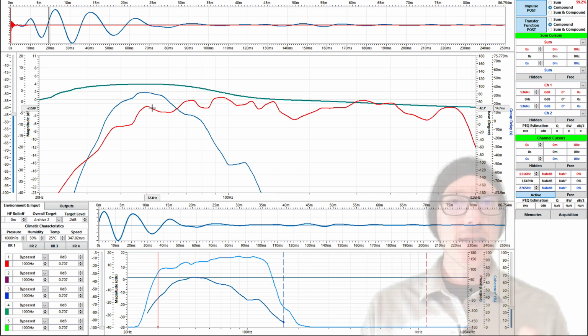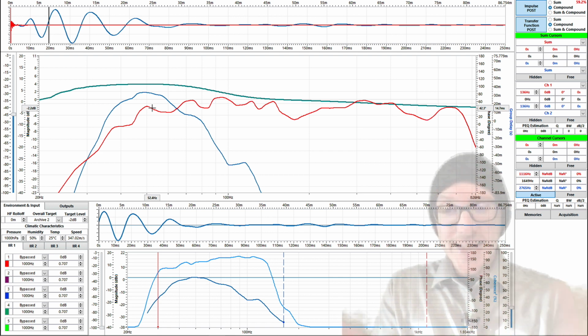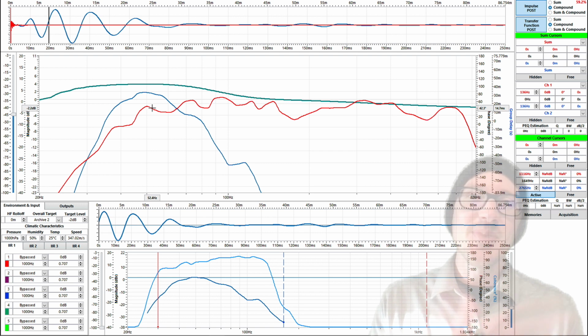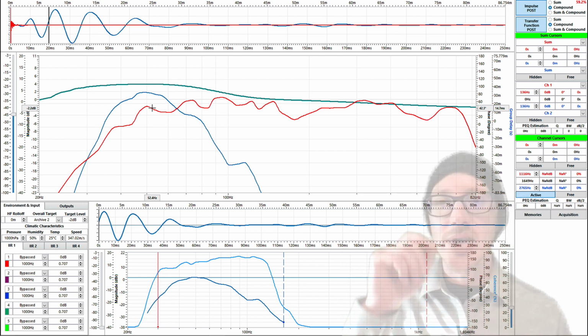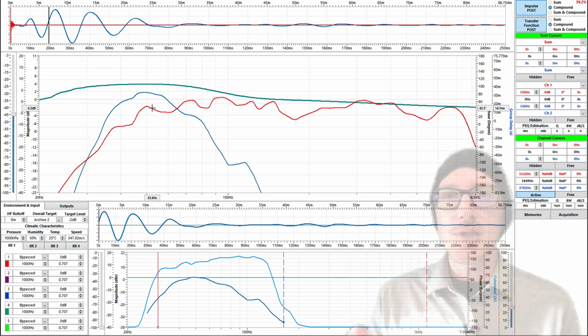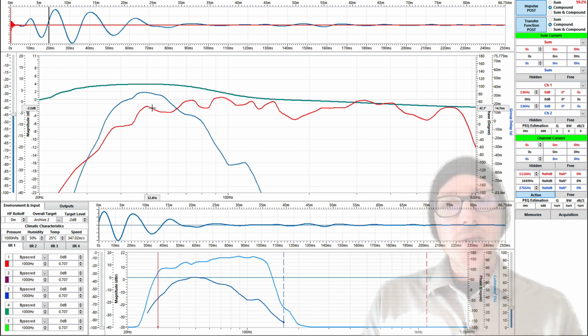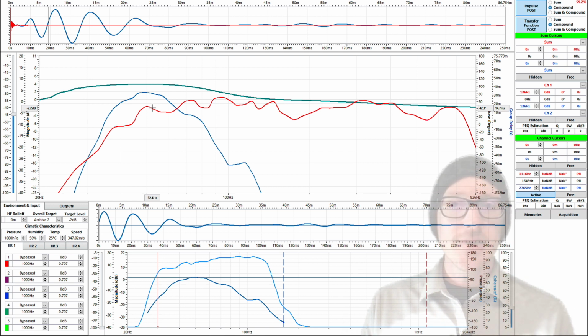We're going to look at delay, polarity, filter slope, topology. There are all these little details that you can play around with, and that's the fun of this. If this is not fun for you, then you're probably not watching this video, or you're watching this video and you're hating it. But this kind of puzzle is really fun for me, so I like to play around with this stuff. Okay, so first we're going to look at starting with the magnitude, and then we're going to look at starting with the phase instead. So let's see if I can hit a target overlap that I'm looking for.